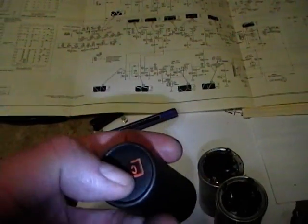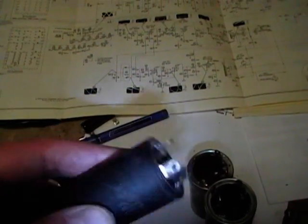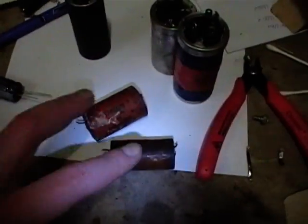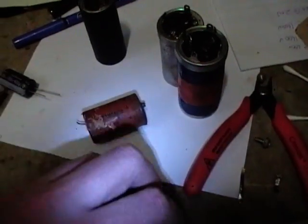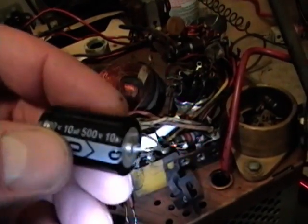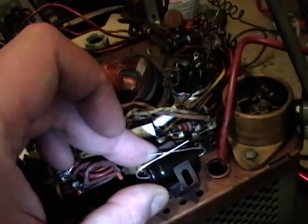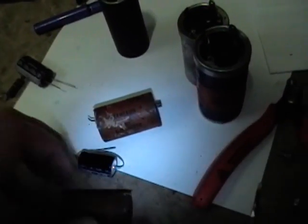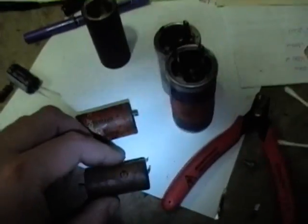There's usually a glob of tar at the base and you need to heat that up to get these out. This outer sleeve is actually a little bit loose, but this cap is pretty well stuck on the end. As far as these two cans go, I could just put the new cap in — for example, this one is going to go here, but it's much bigger than that clamp and it's just going to flop around. So I could wrap some layers of cardboard to build up the diameter, or I can take the old cap and stuff the new one inside, just making sure they're mounted securely in the clamp so the connections don't come loose.